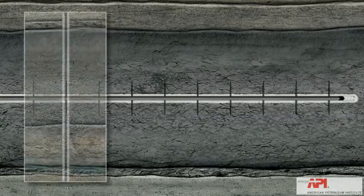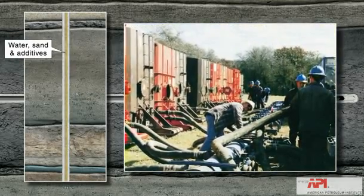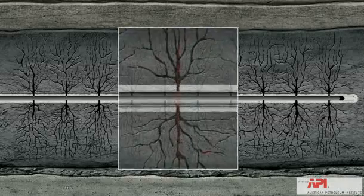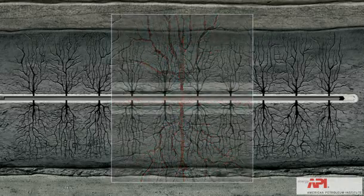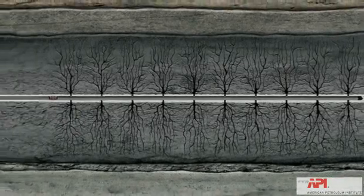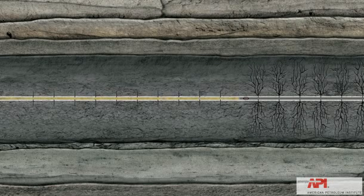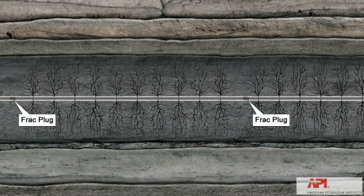Because the shale is tight or compressed, the well will have to be fracked. Known as hydraulic fracturing, this is a process where water, sand and additives are pumped into the wellbore and down the casing under extremely high pressure. As the mixture is forced out through the perforations and into the surrounding rock, the pressure causes the shale to fracture. This creates a fairway connecting the reservoir to the well and allows the released gas to flow to the wellbore. A temporary plug is placed at the heel or left side of the first stage frack. The plug closes off or isolates the perforated and fracked section of the wellbore so that the second stage section of the horizontal leg can be perforated and fracked. Tight reservoirs do not contain natural fractures and therefore cannot be produced economically without hydraulic fracturing. The permeability is increased by providing pathways through which gas can flow more easily.